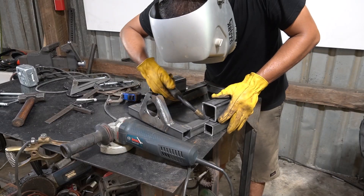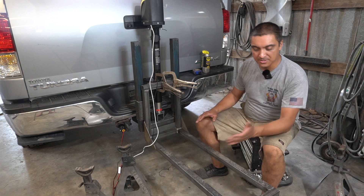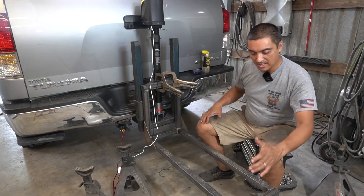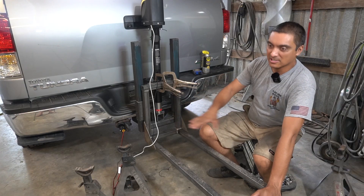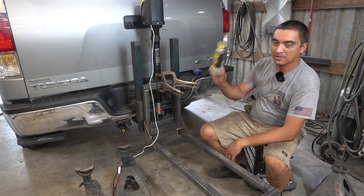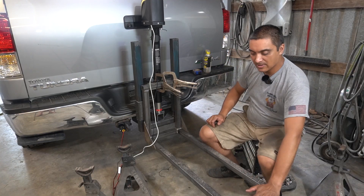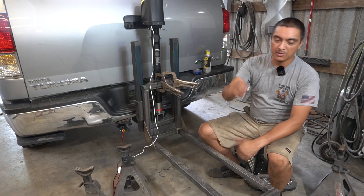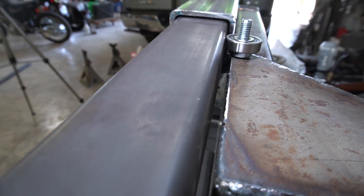We got our two and a half inch square tubing welded to the back side of the elevator and it fits on the frame, but doing some testing with my weight out here we encountered an issue. It'll go up just fine but the weight out here causes it to bind and then it won't drop — the lifting leg just lifts up and you've got to jump around and shake and hope it drops. Tried lubricating the frame with silicone lubricant and even coated it in grease, which works better, but there's still enough force that it binds. We're going to have to adapt and overcome.